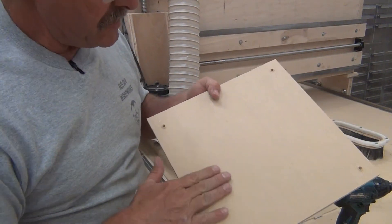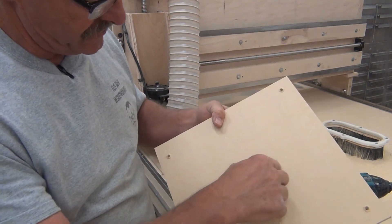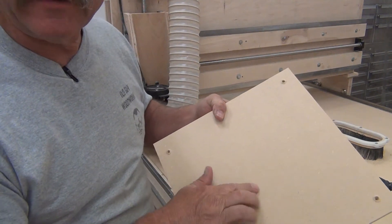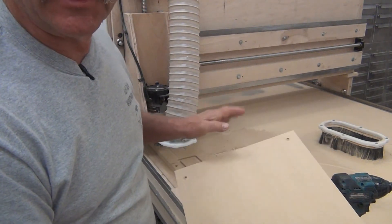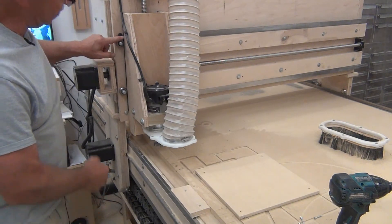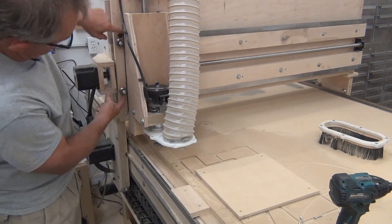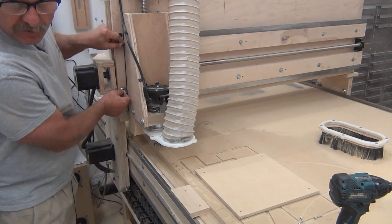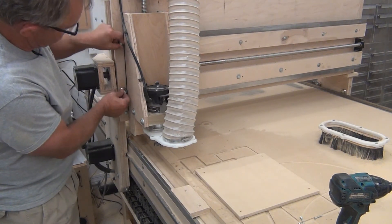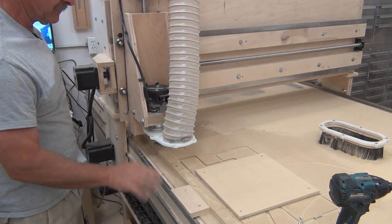That X-Tram is perfect. There's a tiny bit of ridge but that's only like every two inches, so that came out really well. I won't even have to adjust that. But if I needed to, I could just come here on my Z-Axis — all four bolts or four bearings are all in eccentric bushings and I can adjust them and make this thing tilt however I want. But I don't need to. We're good to go.